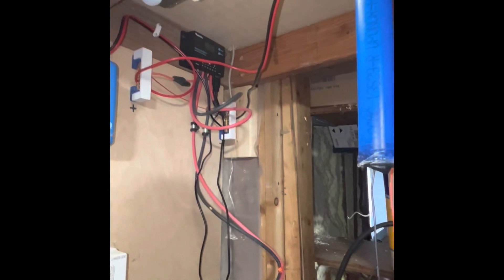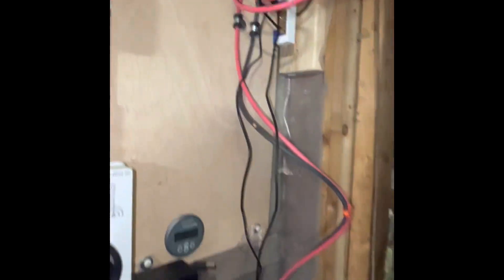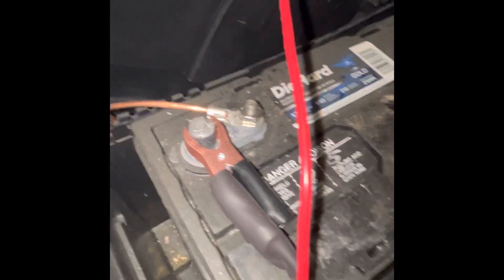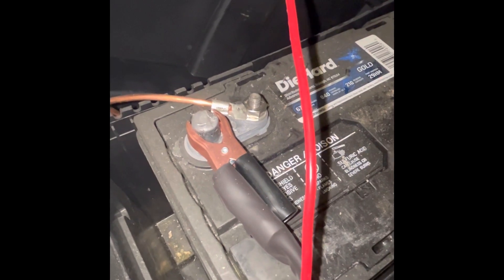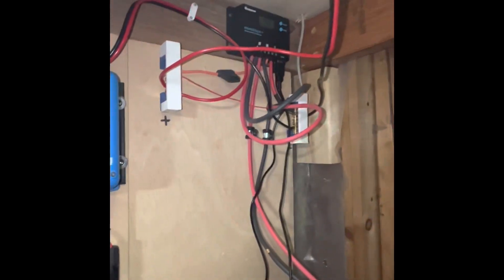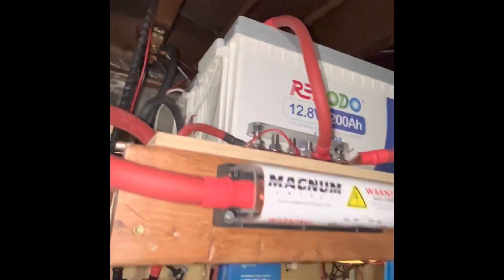I also charge little things with the USB ports. I put these copper clips on here — clamps, or whatever they are — so that if these batteries are full and I'm not using it too much, I can just unclip them and clip them onto the bus bars. All I'd have to do is change the settings in that charge controller over to lithium iron, and then I can charge up these batteries with that system also, or my lawnmower battery or any other battery — but you want to have it grounded just in case.